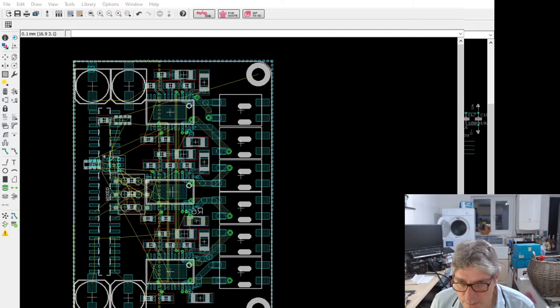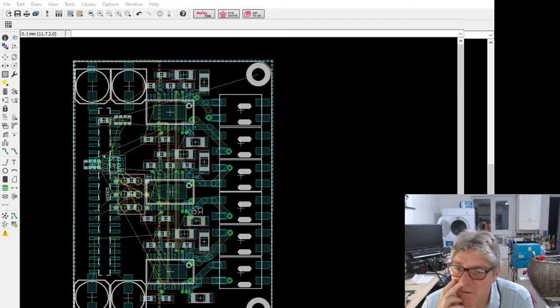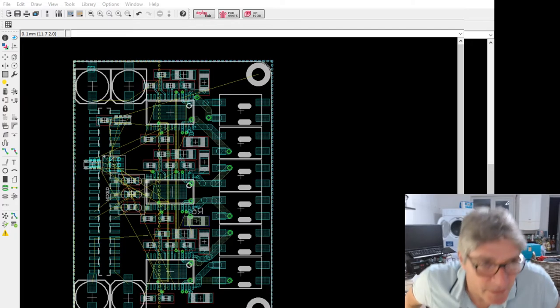So I'm using all those pins up. Let me tell you what I'm not using. I'm not using the CS pin. I need to have a think about using that, because I'm not using the SPI. There is no SPI peripheral on these steppers. So I can use the CS pin to do something. I could use that to trigger an activation on any of the end stops.